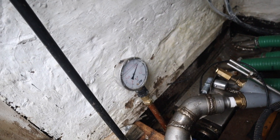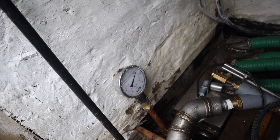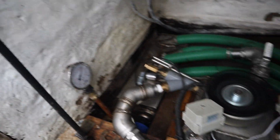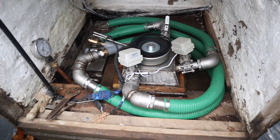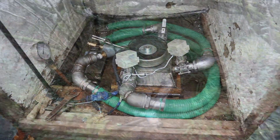We've got about five PSI of loss — four and a bit, four and a half, five PSI of friction loss — which isn't too bad, but we're still going to improve that hopefully. It takes time. Let's go and see if cleaning the pipe has improved our efficiency at all.